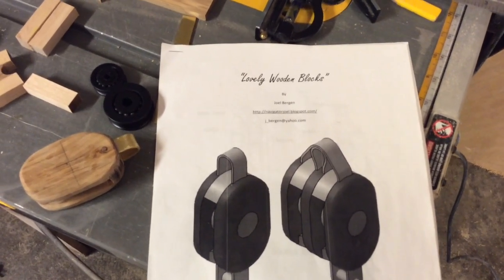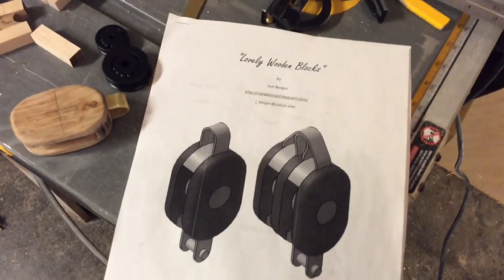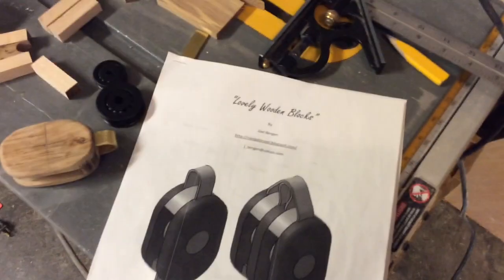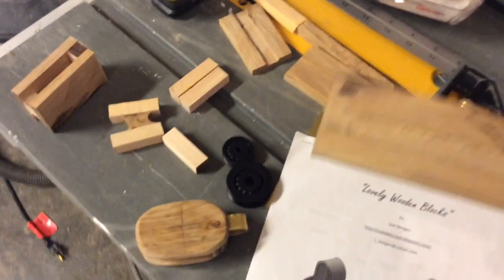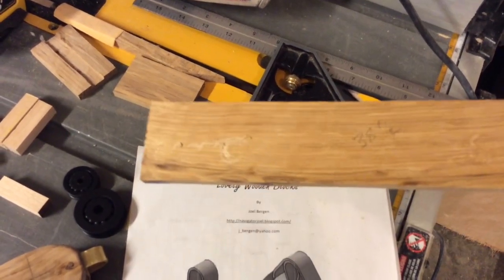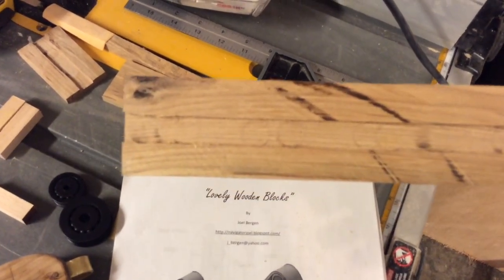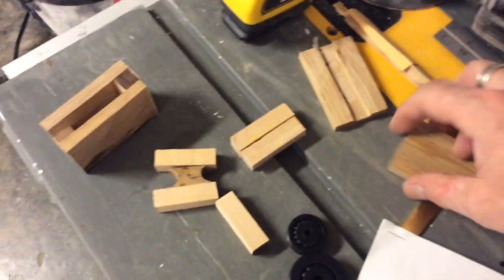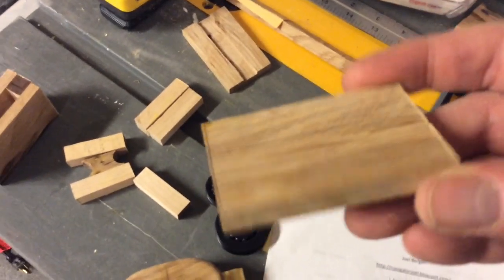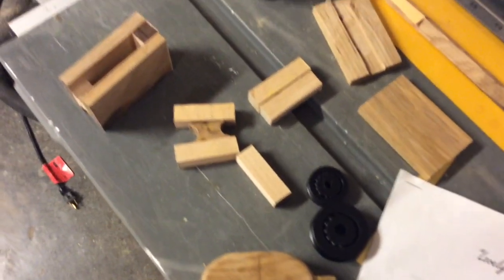I thought I'd try my hand at it. One of the things you've got to do is route out the inside of the wood with a half-inch router, a sixteenth of an inch deep. I've got some oak left over from a tree I cut down. One thing I learned: do the routing with bigger pieces before you try to cut them to size, because trying to run small cut pieces on the router sounds like a good way to cut your finger really bad.